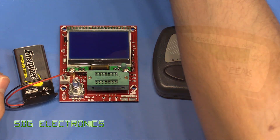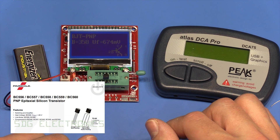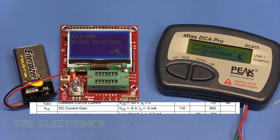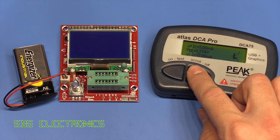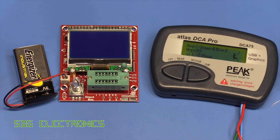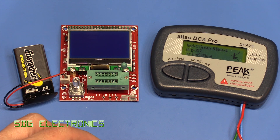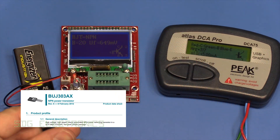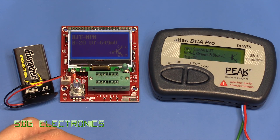We've got some transistors. I'm not sure whether I like the ZIF socket or not — this one doesn't seem to quite fit in and the transistor was starting to rock from side to side. But it's come out with a PNP transistor with a beta of 358, somewhere in the region in terms of the gain. A lot of these HFE parameters are fairly useless for practical purposes unless you're just switching and want a ballpark figure for the base resistor. A second one with a gain of only 20 is identified as NPN — pretty similar, it seems to do the business.